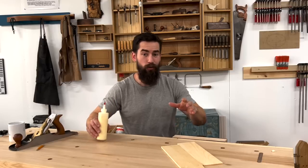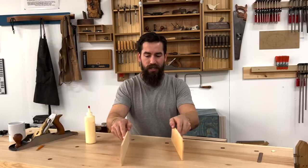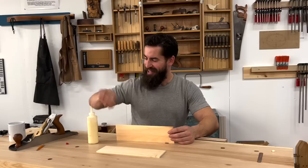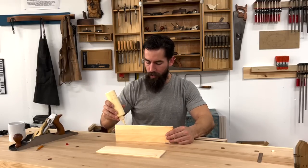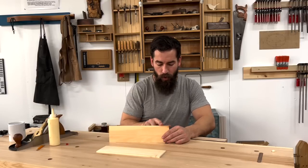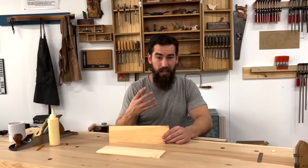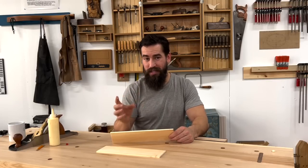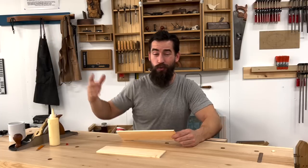That's really all it takes. Now gluing this up is about the easiest thing you could possibly do. I'm going to stand up my two joints, take a nice thin bead all along that joint. You don't want much — what you want is a very thin film, because the whole point of the rub joint is that you're essentially taking the fluid and rubbing it between two surfaces, and that creates a vacuum to hold those two pieces together. That's what I was taught by a bunch of crotchety old British dudes who taught me woodworking.